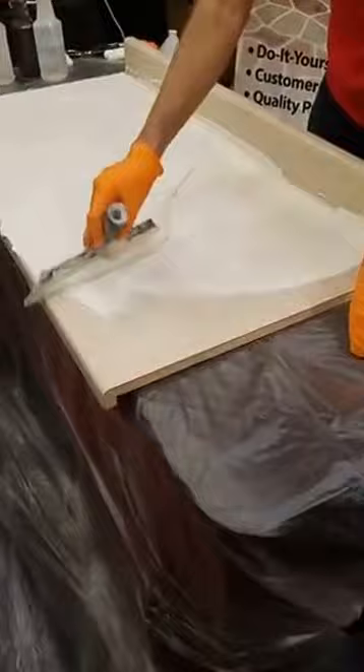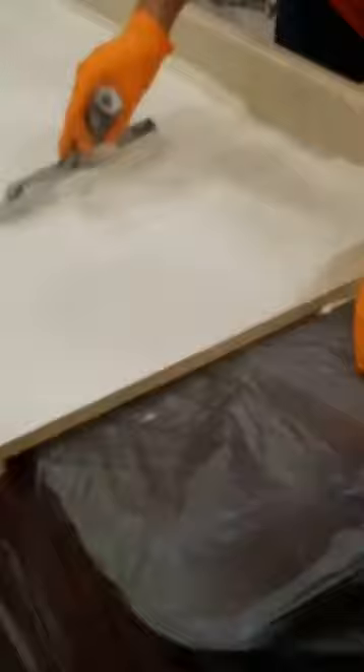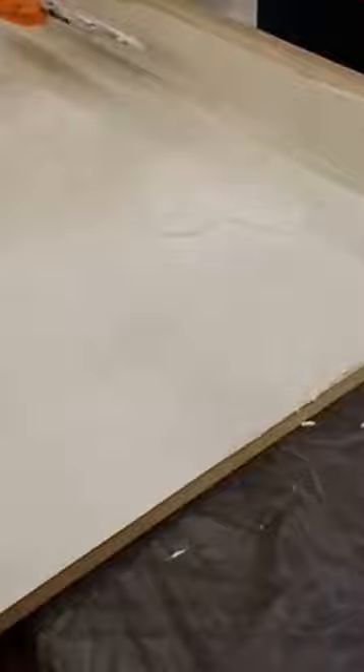It's 1/16th of an inch. Once this was sanded, it was 40 grit. The main thing at first is just trying to get a scratch coat on there — something to help your next coat stick even better and more smoothly. It does not trowel that great on uphill surfaces because of the nature of the product. Normally I take it to vertical surfaces and just bring it around these edges to get a good scratch coat on there.